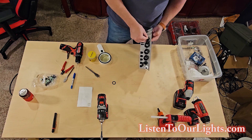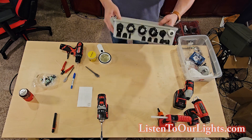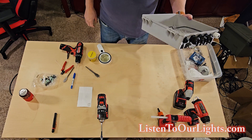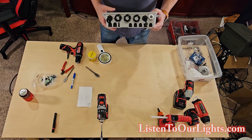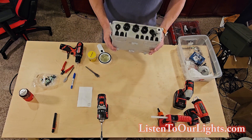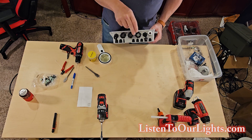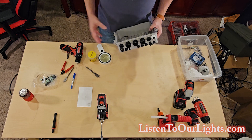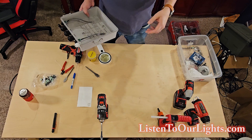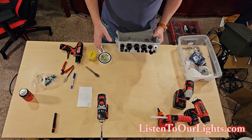The other RJ-45 port. So that's my least favorite part of the controller build — dealing with the enclosure. This is data, usually this is the one I use for ethernet, then I have pixels, pixels, pixels. This is another data port, usually. I keep an option to get to the serial output port in case you want to hook up a Light-O-Rama or one of those transmitters that does the bracelets, and then this one is for the power.